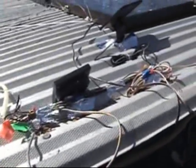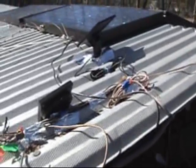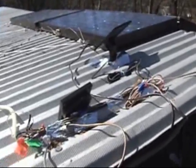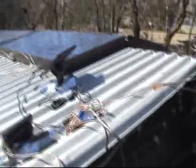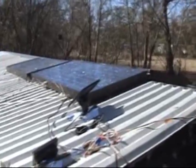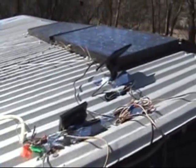What all this is about is there's a relay system that operates, basically clicks on the solar power. A little solar panel here, 6-volt, keeps a little 6-volt relay that I have in here activated during the day. When it cuts out, the 6-volt battery that I have inside the shed operates the light. I've used the relay system basically to turn off the lights during the day, and when the solar panel quits getting light, the relay disengages and the circuit's closed, therefore pulling the battery power to the light.